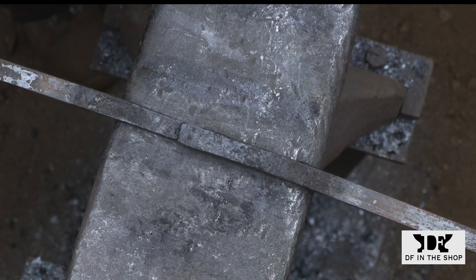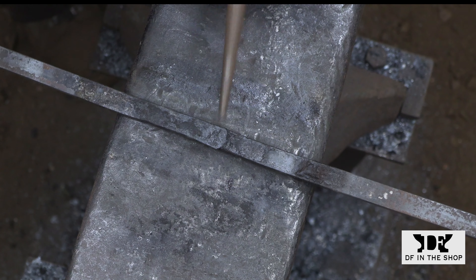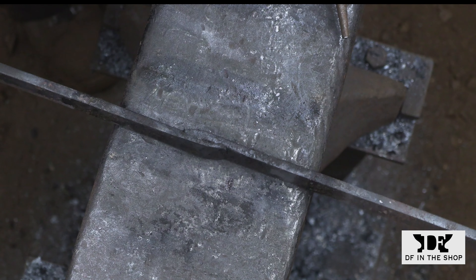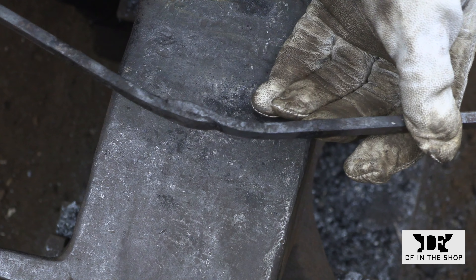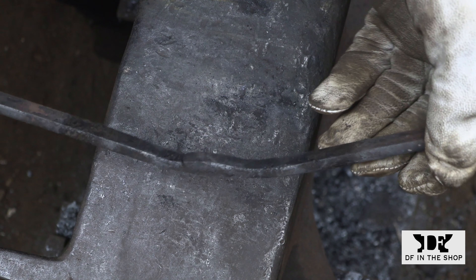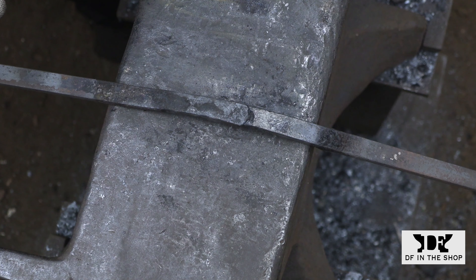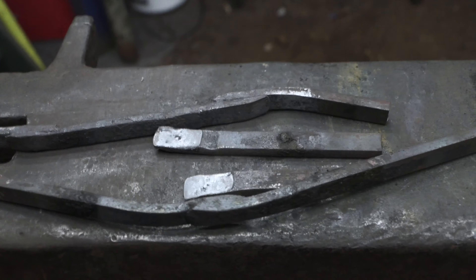So this is the finished weld. It's not as clean as the first weld that I did with new material — there's obviously a bit of pitting and a little bit of damage from the first two failed attempts — but the edges are starting to blur and the bend test does show that I did get good surface contact and there is the potential to have a good weld here. So don't be discouraged if you miss your first or even your second attempt at getting the welds to stick. You do have time to regroup, reset your fire, and get a good weld out of it. The important thing is to keep practicing, concentrate on getting the welds to stick first, and then everything else is going to fall into place.